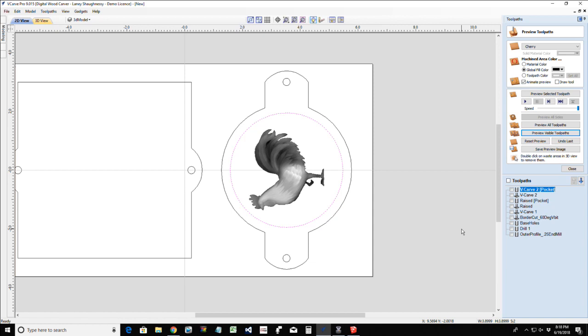So Howard, the 3D would be a little bit better on a 3/4 inch piece, because then I could mill it down and have a shape height of whatever I want. And then my finished piece could still be down to that half inch thickness, because the first 1/4 inch of that material would be carved away. But yeah, if I wanted to cut it out of two separate pieces, yeah, or if I wanted to do the whole thing out of the 3/4 inch piece, absolutely.